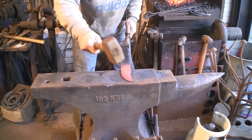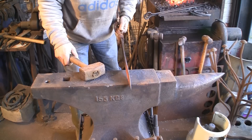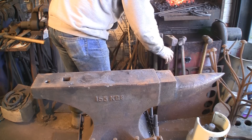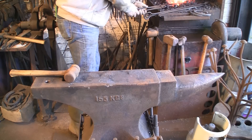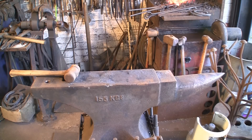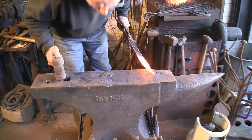I want to keep some of the teeth - I like the look of them. Probably thinning down towards the point and that edge. Doing it this way, forging it, I'm actually going to get a wider blade than I would have done if I'd cut it with a grinder, because I'm forcing the metal out, making the rasp actually wider. So even though I'm going to grind quite a bit off, take off the teeth at the top and bottom, it's still going to be slightly wider than I would have got by grinding.